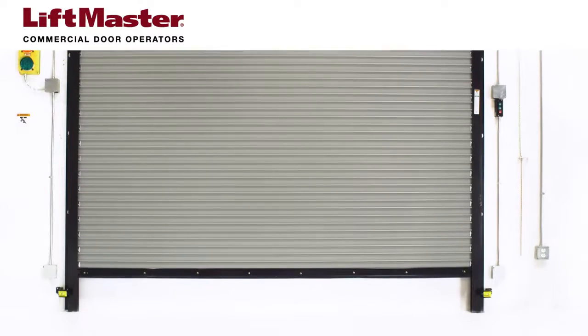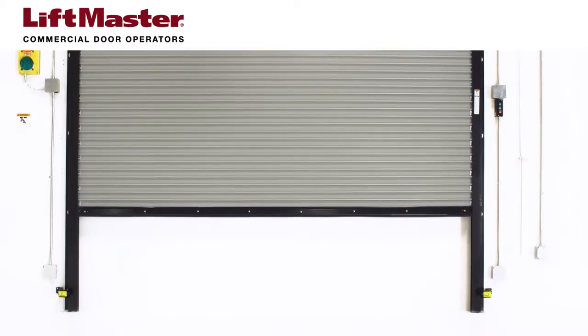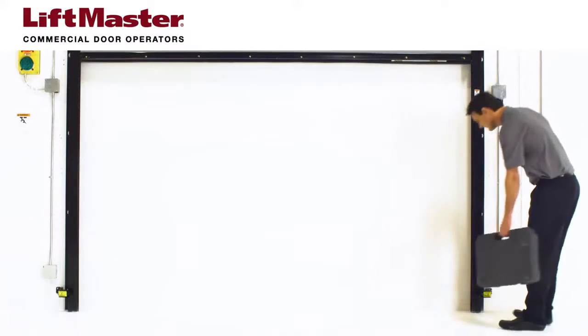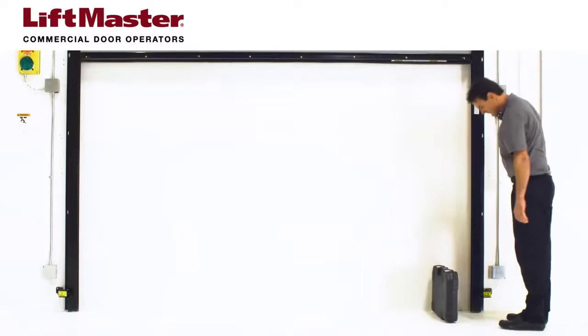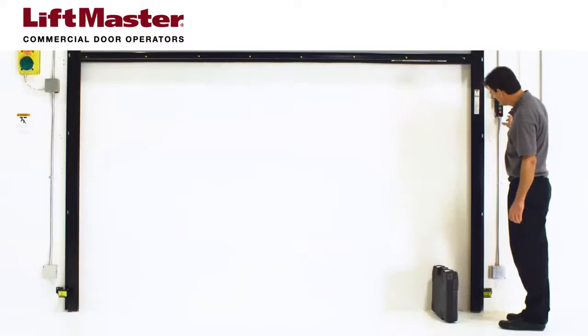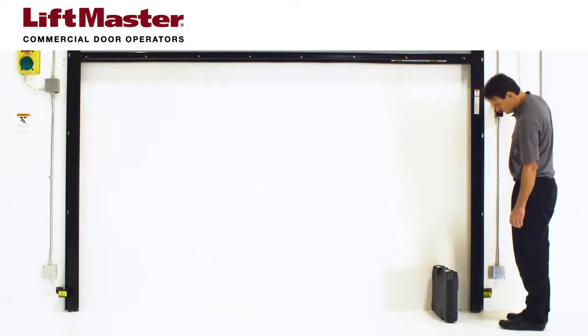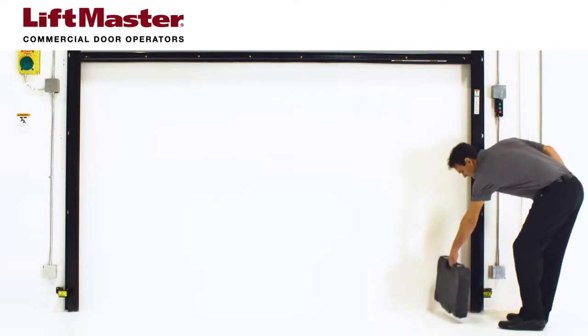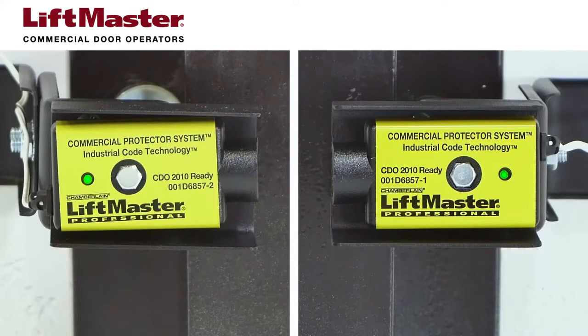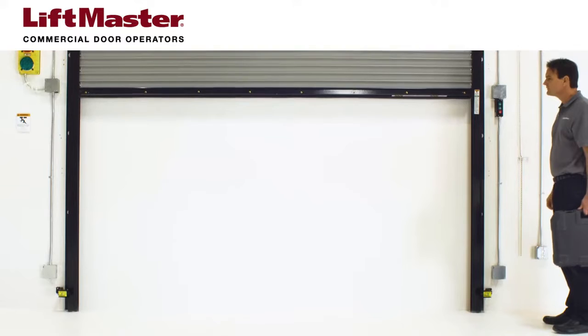Test the protector system to ensure the first set of sensors is working properly. Open the door fully and place an obstruction between the photoelectric sensors. The LEDs on both sensors should begin blinking. Stand clear of the door and give a close command. The door should not move. Remove the obstruction. The sensor LEDs should revert to solid green. Give another close command. The door should now close.